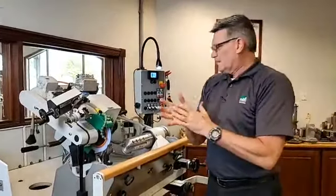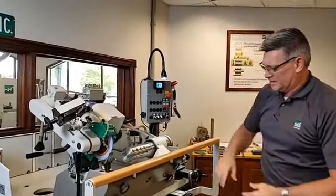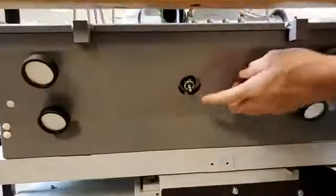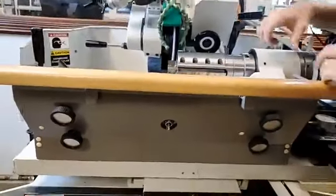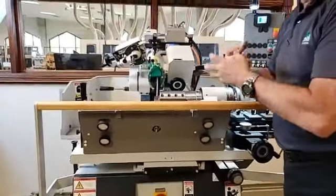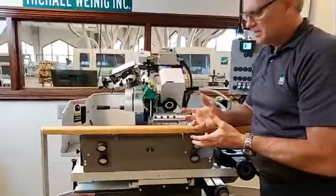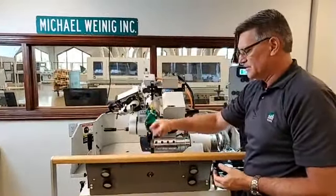Okay, so now for actual greasing of the machine, like we had talked about before, some of the maintenance stuff. One of the main things, I don't know if you can see this right here, Christian, there's a small greaser right here on the front. And what we're doing with this is we're making sure that we're greasing the pivot point of this whole cast assembly. So when we turn it from side to side, we're keeping it lubricated, things are staying fresh in there. So we just want to put the grease gun on here, just the maintenance gun with the R2 grade grease that comes in them. And we just want to flush until we see a little bit of grease coming out around this surface on the front side.